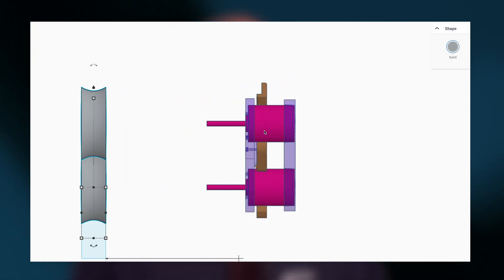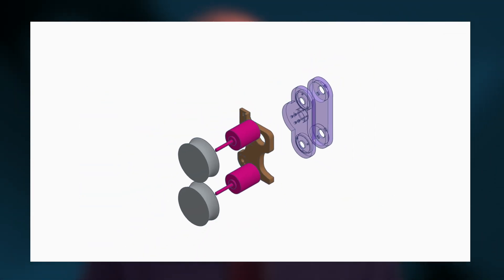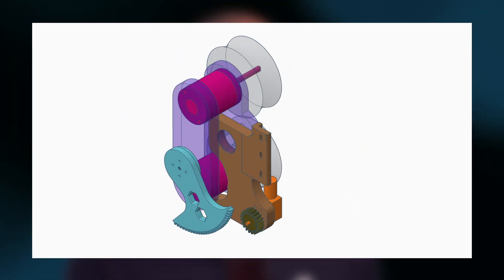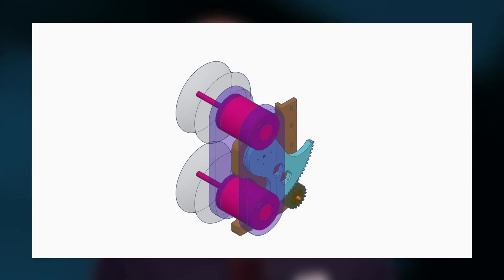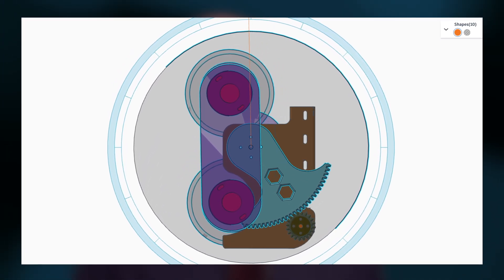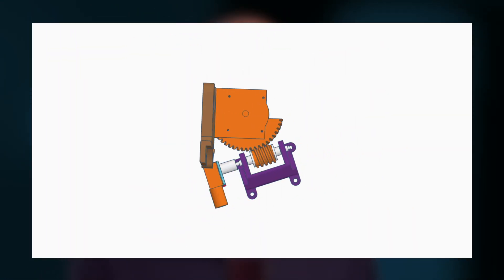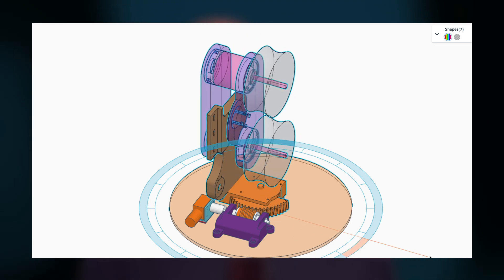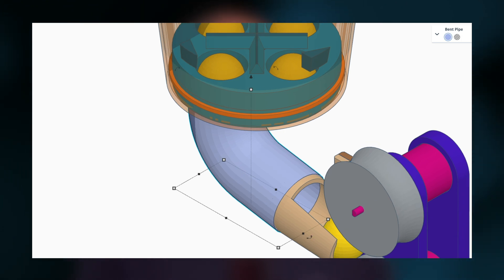Here it is. The motors are connected to the main vertical pivoting arm and the wheels go directly onto the motor's shafts. There's a bracket that stabilizes the motors when the balls are being thrown out. For vertical motion, I mounted a gear motor directly onto the fixed vertical arm, which drives a small gear that transfers to a larger gear fixed to the motor's mounts. When the small gear rotates, the motor assembly swings up and down like this. Using position control, we can control the vertical angles. For horizontal motion, I'm using a worm gear mechanism that swivels a base plate with a gear ending. The base plate sits on a lazy Susan bearing, giving it the freedom to rotate. And finally, the ball feeder is connected to the fixed arm using a duct pipe like this.